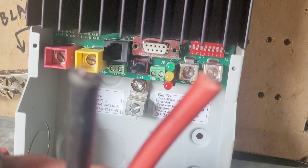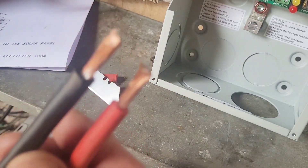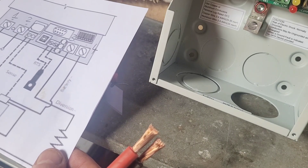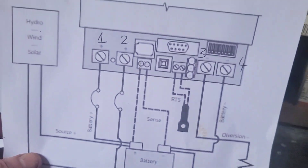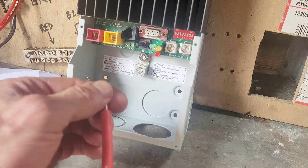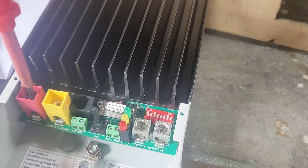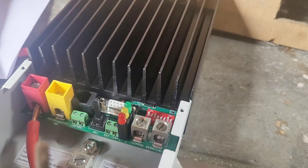The wires are split and I'm just going to get a stanley blade. Right, so these are going from the controller to the battery — that should be connector one and connector four. Positive battery positive goes to number one. I'm just going to check the size — should have enough. Let's make sure this is all the way out. Let's just give it a go.